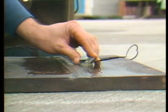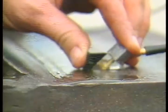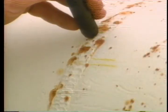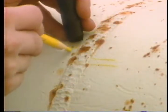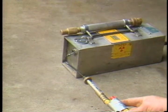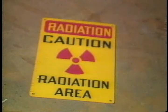Now let's review. When you're asked to clean a weld for testing, you need to know what kind of testing technique will be used. The non-destructive testing techniques that require cleaning to bare metal are liquid penetrant, magnetic particle inspection, and ultrasonics. Good sound paint can cover welds if they're tested by the electromagnetic detection method or by visual examination. You may have heard of other types of non-destructive testing like X-ray. These types are used on our rigs during new construction or reconstruction of things like crane pedestals, but X-ray is not used during annual inspections. X-rays are dangerous, so if you hear that X-rays are being done, it'd be wise to stay away from the test area.